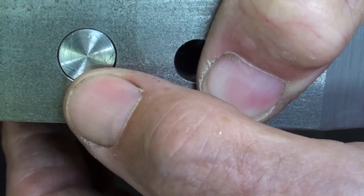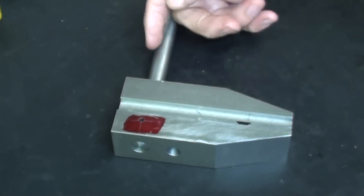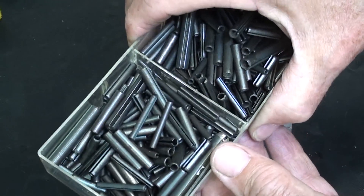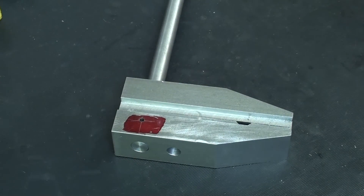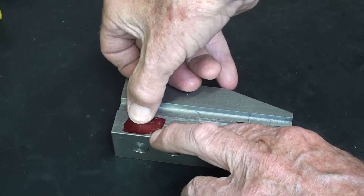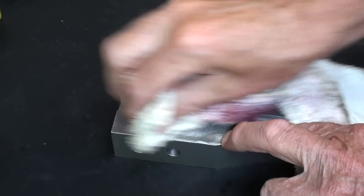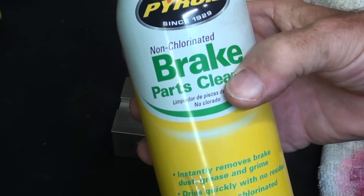You will be so discouraged you'll go upstairs and never work again in a shop. Also note there's a little witness mark there toward the top, because more than likely this could not be assembled in 180 degrees, and that'll take a 1/8 inch roll pin — spring pin, drive pin, whatever you call them. But I'm temporarily just using a piece of 1/8 inch filler rod so I can take it in and out at will. Some viewers ask what I use to remove layout dye, and my favorite and the cheapest is brake cleaner.